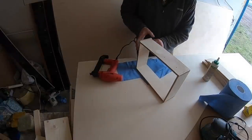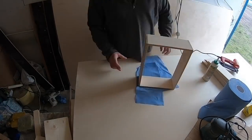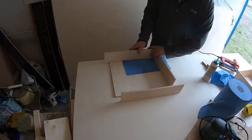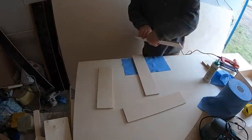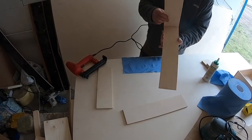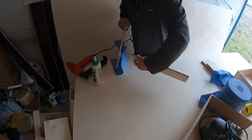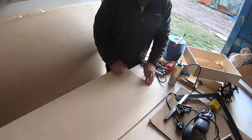Ailey's top tip of the day was to get the brad nailer and just rest it on the front edge of the worktop and then fire straight into the edge of your workpiece, and it just makes the nails go in square and stops them breaking through at a funny angle. So yeah, I've got to give her credit where credit's due, because it was a really good idea, because otherwise they fire through and come through at all funny angles when I do them, because I've got funny hands. That's where I spend too much time, looking at top tips on YouTube. Yeah. When you should be doing work.